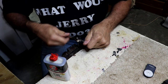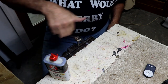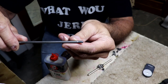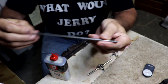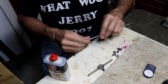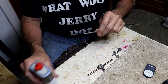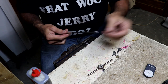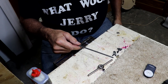I don't think I need to go very far on the one end because I'm just going to put a nut on there and solder it. It's not absolutely perfectly on center, but it's not too bad. On this other end — this is the business end — I think I will take it to the metal lathe and get it on there really good and straight. This end doesn't matter; I'm just going to put a little nut on there, solder it in place, and that's going to be my anchor back in the neck.